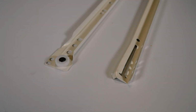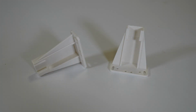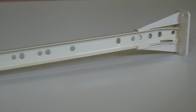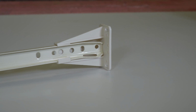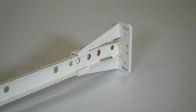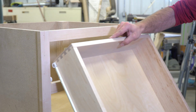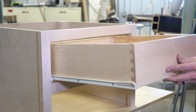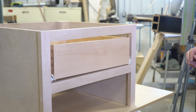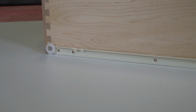Next is the epoxy drawer slide. Simple installation, compatible with almost any drawer box construction type and material thickness. They are extremely affordable. Typically 3/4 extension, and the adjustability is minimal with these. These do typically come factory with self-closing, which means that there's a ramp on the back here that as the epoxy slide gets to the back, it then hits that angled area and self-closes the drawer and keeps it closed. So kind of a built-in feature that's pretty nice, typically pretty standard with your epoxy slides.